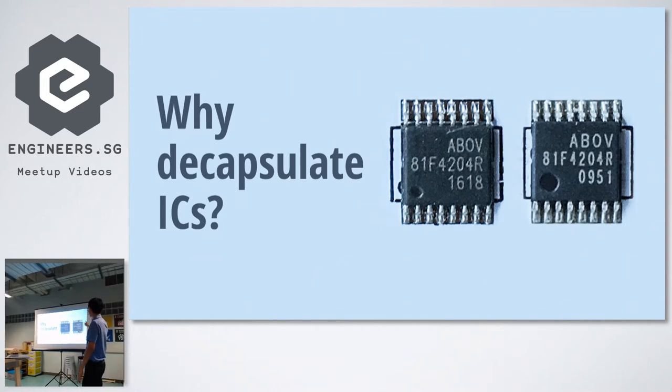The differences are quite subtle. The number four looks kind of filled up on the right one. The letter spacing is a little bit off. And lastly, the registration dot indicating pin one is quite fat on the Taobao one compared to the original. When I saw that, I thought — oh dear, I think I got a counterfeit. Because the Chinese are really good at this technique where they repackage a chip and remark it. It's a very subtle change in packaging.